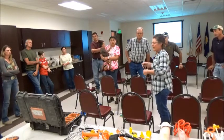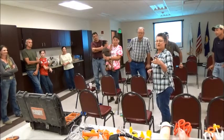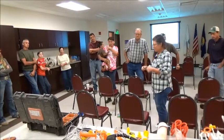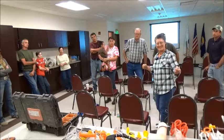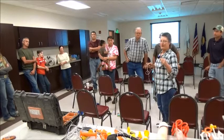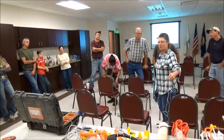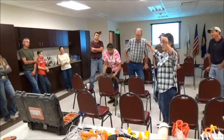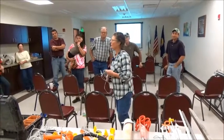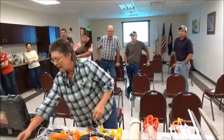So you put the fence up and you'll have 400 cows there. Tell me if I'm wrong. 400 cows standing on that fence, everything's groovy, and the next morning you go out and they're all out. Why? Because it was only hot up to the chewed up place, and then it wasn't hot. So if you ever have a broken fence, when you put it back up, check both ends. And if the one far away from the charger isn't hot, you've got bad twine. And until you learn that, you won't know what's wrong with your fence. You'll hate electric fence because it doesn't work. It works.